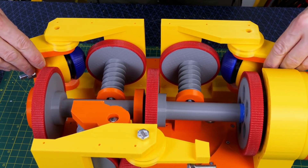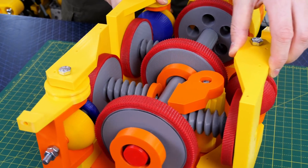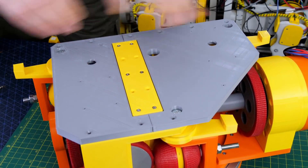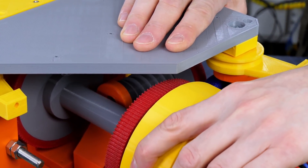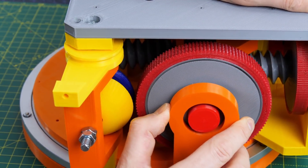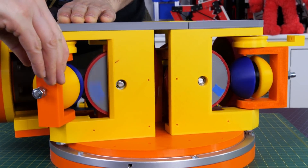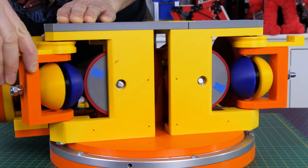Those all run the same and they run about 60 degrees either way. There is some flex in this whole thing which isn't very good because I really need the tolerances to be quite tight - that means the ball won't always run on the tyres. So I've made a lid that fits on there and it pops over the bolts and then it screws onto the top. We still have some issues with flex though so I probably need to redesign that motor bracket so it actually attaches to the top, and the same with the other vertical brackets that support that drive shaft, just to get rid of that flex. But for now it's good for some testing - I've powered the motor up and I've put bits of blue tape on those two wheels that run the worm gears, so you can see as I tilt the balls we can speed up and slow down the output based on the angle of the ball.